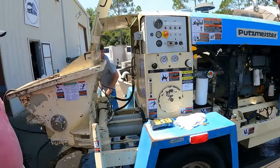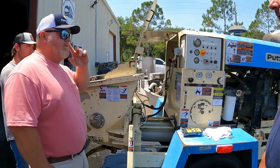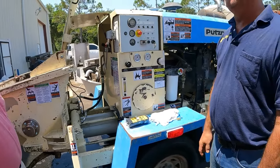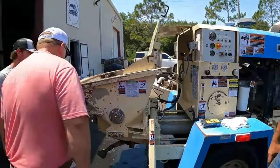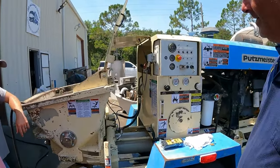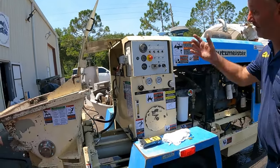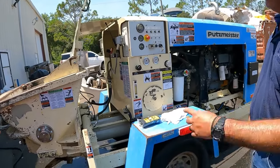What will you see if that gap gets wide, other than the gap, anything? Well, what'll happen is you let it go that much more, and then two times that amount, the cutting ring's going to fall out. You just pump nothing. There'll be a whole gap to it. You won't pump anything. You're dead in the water. You can take a whole ton of power, put the cutting ring back in, slide it all back together. That kills you on the job, unfortunately. Just like your piston cups, if you lose a piston cup on the job, that kills you. You've got to stop, force it with a piece of steel all the way back, tighten it back up. Chances are the bolts have run off, or the threads have, and it turns into a big thing. So you check the bolts, check the end plate.